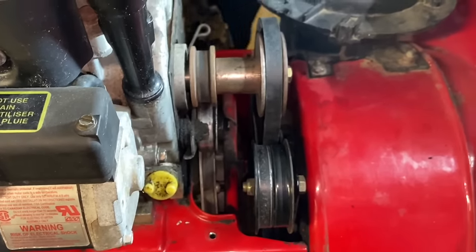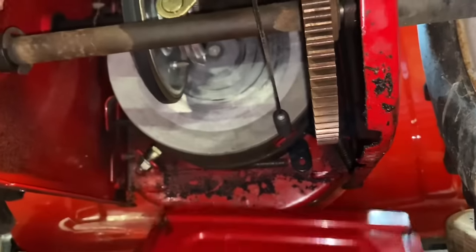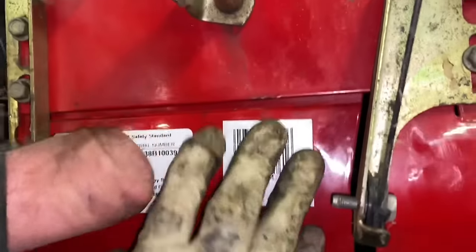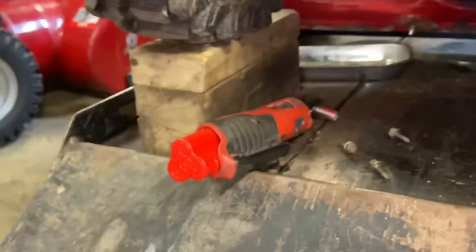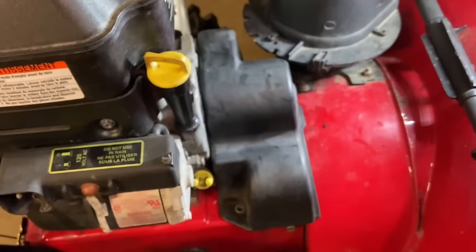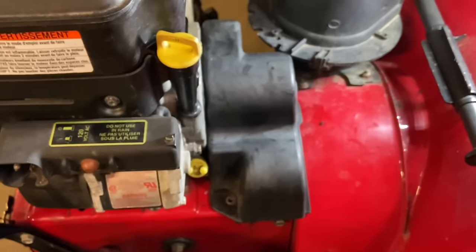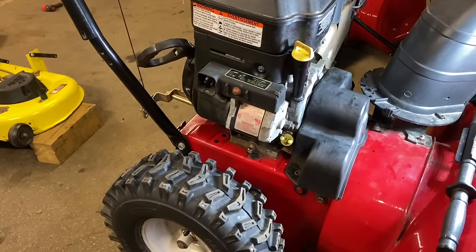When you let go of your handles, the belt guides on the cover will stop the belt from moving. Make sure you button everything up — put your bottom cover on, tighten the bolt, and the pan slides up into the grooves. Always clean out your belt guide and belt cover for your auger. We put our initials on it so we know the date we did it. Get it in there, put your two bolts on, and that should be it. We're all adjusted. Test run it and make sure everything's good. If you like the video, please give me a thumbs up — I appreciate you watching, and please subscribe.